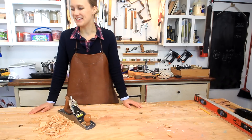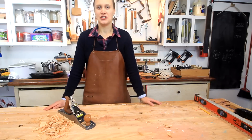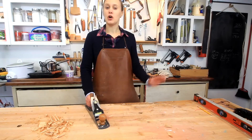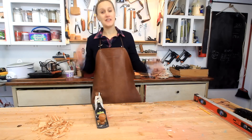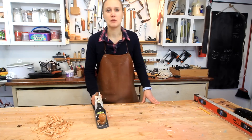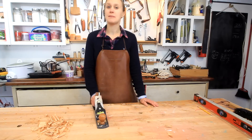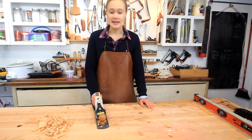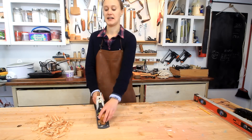This is kind of a fun workout to do, and I actually really like the fact that this is your bench — you can do whatever you want with it. So I like to be rough with my bench and do a whole bunch of different things with it because it's easy enough to clean up. The whole point is basically to get the job done. Now, if I was doing a more finished table, like a live edge coffee table or a big dining table, and I wanted to make sure it was flat, I probably would set up a sled and a router — it would do a more finished job. But here I'm more concerned about getting the job done. It doesn't have to be perfect. It's a workbench, and I just find this easier.